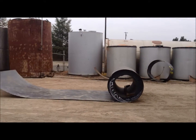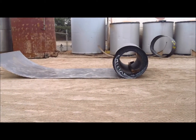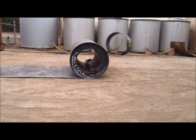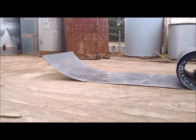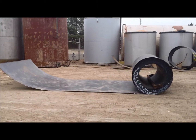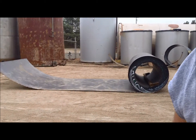We try to buy our steel directly from a big service center. What you're looking at right here is a 3-sixteenths coil. We buy about a 40,000-pound coil so our cranes can pick it up. Whenever we get into fabrication mode, one of the methods we use is to just unroll the coil the amount of steel we need, and we can easily roll it and build a shell. This eliminates having to piece together a bunch of small pieces, and ultimately it's quicker for us to build the tank.